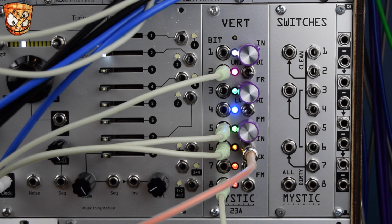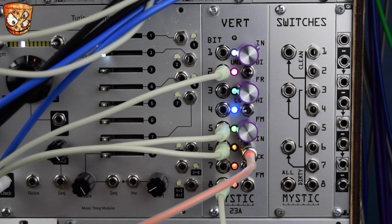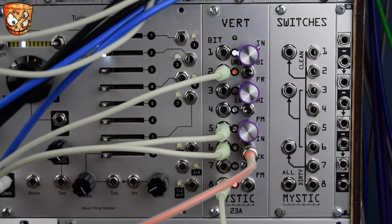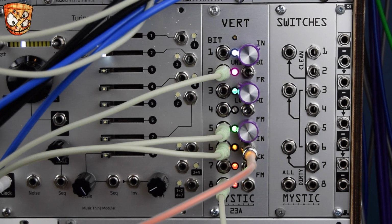At the clock rate set by the module, there's an internal clock and some clock FM that we're going to look at in a second. This is now sampling whatever's in that counter and firing out gates. And unlike a comparator or other similar modules, we can have different outputs present at the same time, not just one or the other. So it's not just converting that raw CV into 8 different steps, we're actually getting this counter that can fire out multiple values at once.